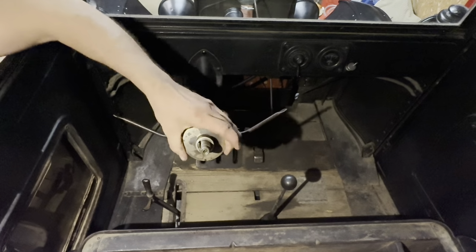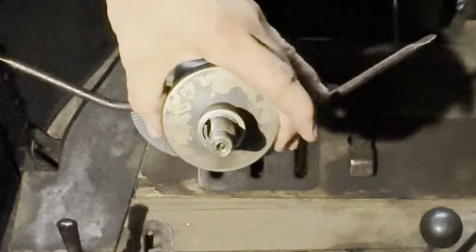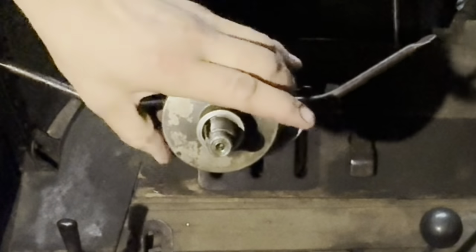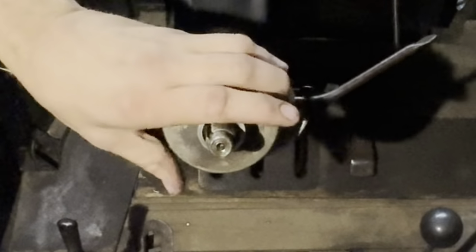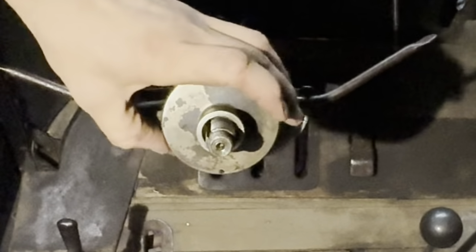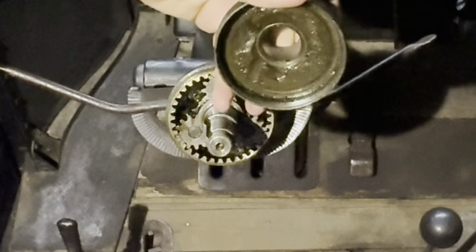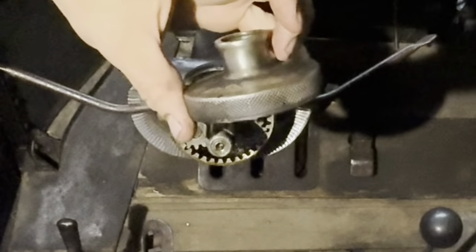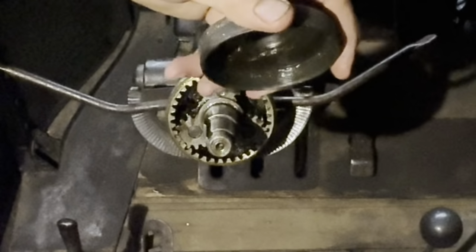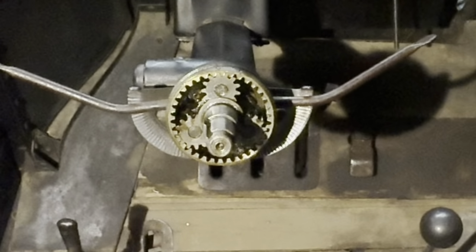Anyway, this collar comes off. The point of this too is I wanted to show you, I actually wanted to clean up some of these parts as well. We'll clean up this. It's got a lot of thread on it. It comes off. Underneath there it hides your sun gear and the planetary gear carrier and the planetary gears and the ring gear. So anyway, that all comes off. And hopefully you guys can see that. Some interesting knurling on there. I just wanted to get all the hand grease of 100 years off there and tidy that up before I put it back together. Some grease in there.